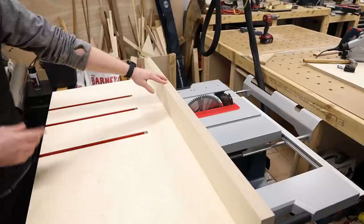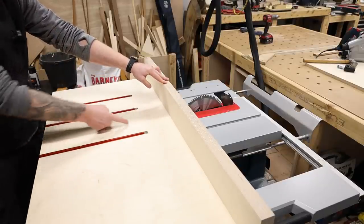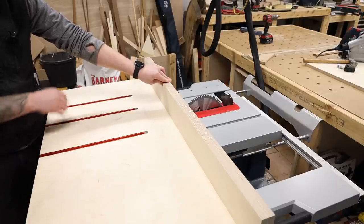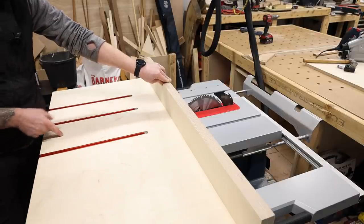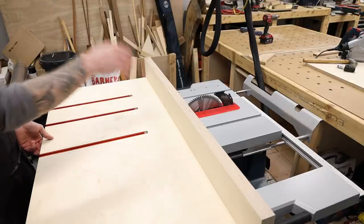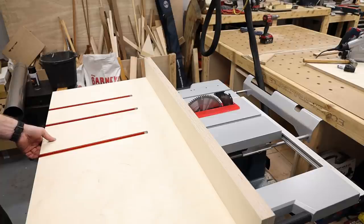Now I'm going to put the kerf of the blade into the sled. I'm not going to cut it all the way through yet — I'll do that when the front fence is finally in place — but I want to run it just a couple of inches in from the edge so we can use this to square the front fence. I have the cross-cut blade in, no guard on it, so I have to be extremely careful. This is a heavy piece, so I just want to keep my hands well away from that blade. Goggles and all protective gear on.